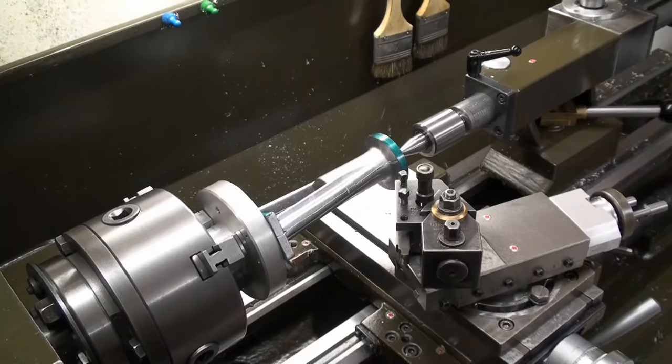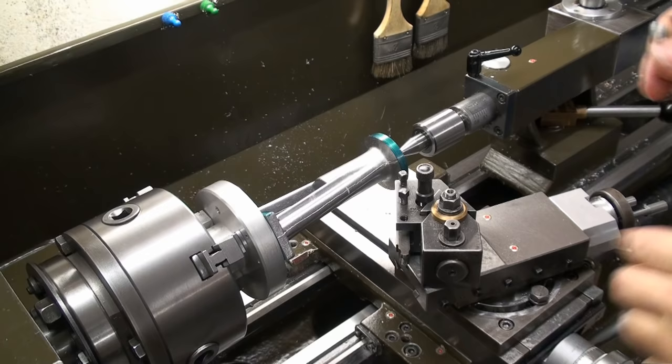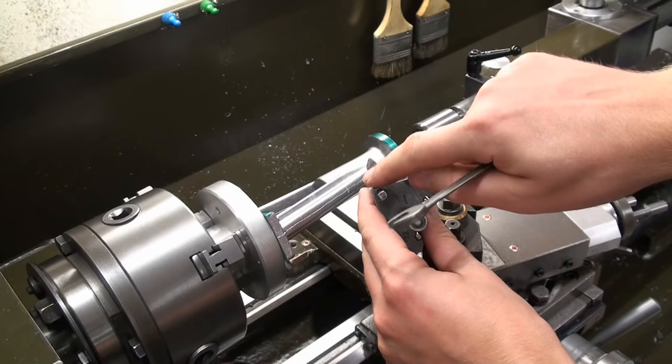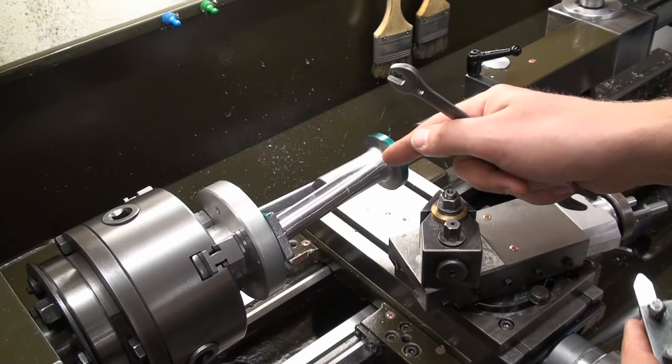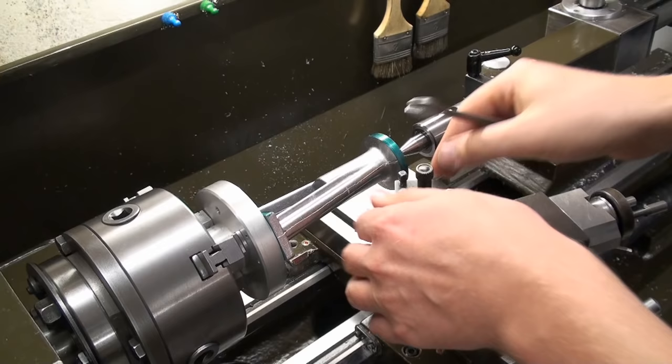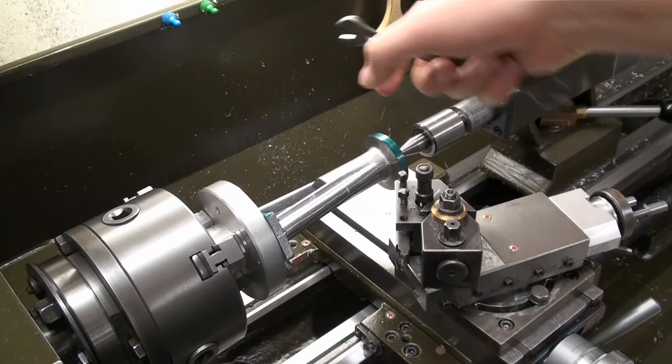Okay, now we machine the left side of this flange, and I brought the tool post around so I can get in with this tool I found in my collection. This is a straight tool with a nice nose radius, and with nose radius I will create a nice intersection between the machine area and the casting itself, so you don't have a sharp corner there. You might be able to see the scribed line here. That's where we have to machine to. The final thickness of this flange will be 5 millimeters.